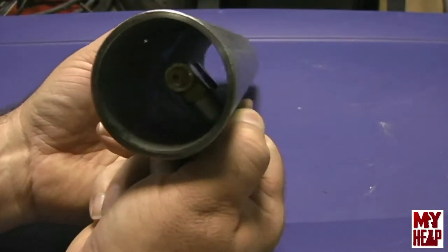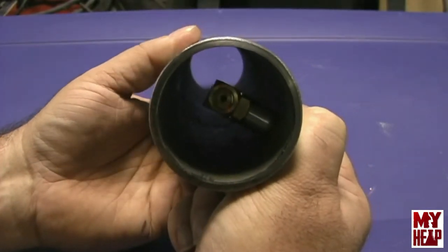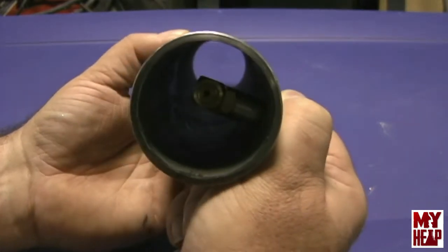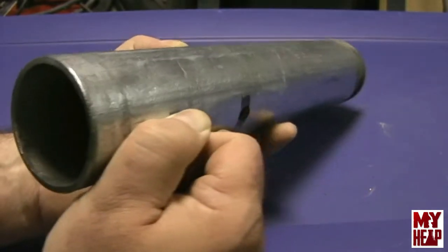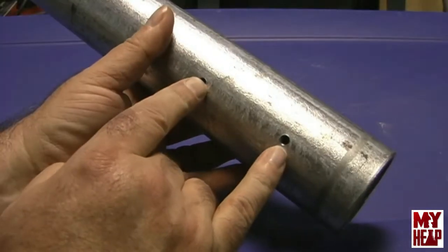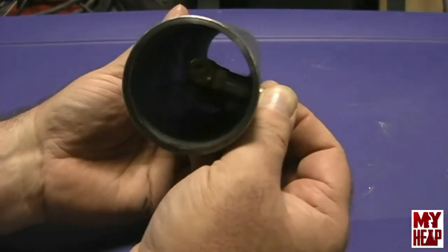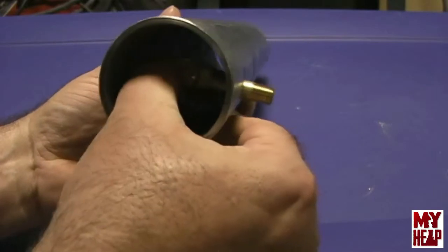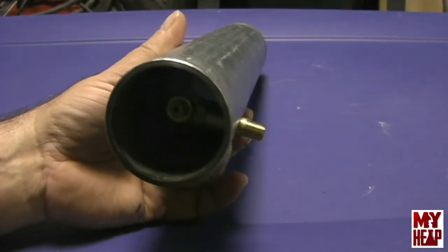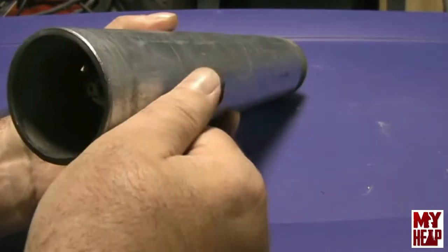If you can see in there, it centers the jet in the middle of the burner tube, and it's being held offset by the spacers. There'd be one on each end, and over on this side, I've tapped two 1/4-20 holes where I'll put some studs, some all thread, down in there, and that'll push up against the burner and hold it in place. That's my intention anyway, and I wanted to show you before I start putting this together so you had an idea how it went together.